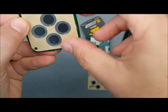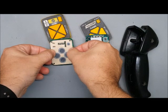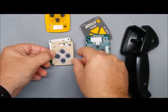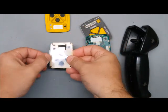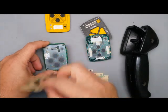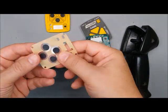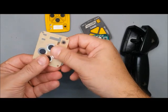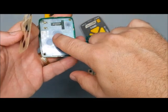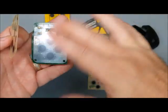Use the cutouts around the LEDs to line it up. It doesn't have to be ultra perfect, but you want all the holes clear so the rubber tabs can go back down through. If you don't get it perfectly right you can peel it off and put it back down again. Try not to bend it — we want it as flat as possible. If it's cupped inward it could permanently hold down one of the buttons, like something's stuck holding the button down.